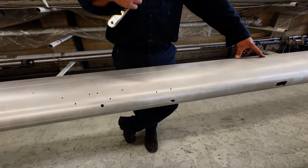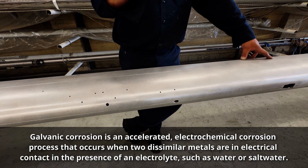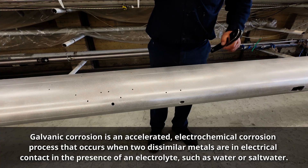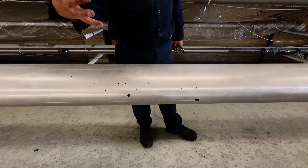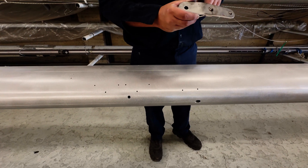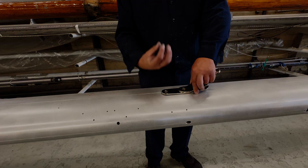You mentioned that we're going off the Great Lakes, so everything will be Sikaflex'd. Anywhere a screw contacts the mast, the threads will have Sikaflex on them as well as the component that touches it. In this case, this has been powder coated. This is the layout for your camera. The base itself will not be Sikaflex'd, but the screws will be. Underneath here will be Sikaflex'd and then bolted through with nylock nuts on the other side.